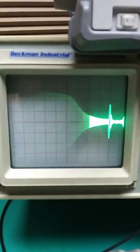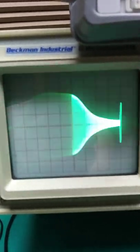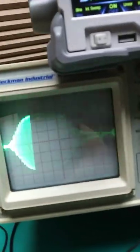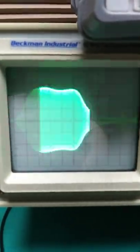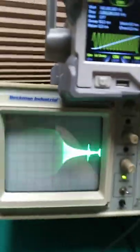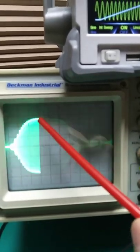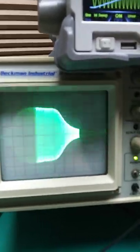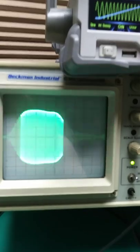When I tune the filter transformers, we get some dipping and peaking and all that stuff — that's T13, this is T6. But the goal is to basically get a flat response across here and square on the edges. Well, that's not going to happen — not with this filter that only has four crystals. The TR4 filter is better.